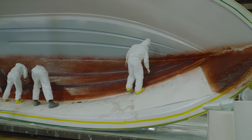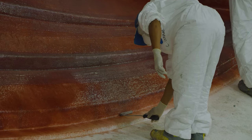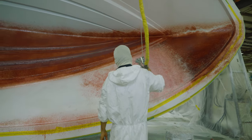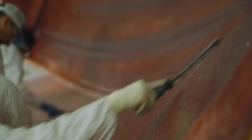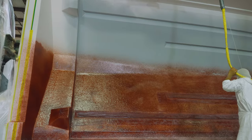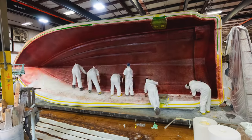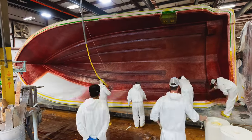This layer plays a crucial role in every fiberglass part as it is the first line of defense against water penetration. In infusion, the skin layer plays a key role in achieving a smooth, finished surface. Skipping this step would result in what is commonly referred to as print. Printing is when the ghosted texture of the woven fiberglass appears in the final part.